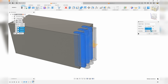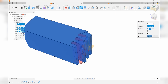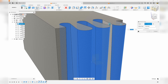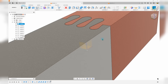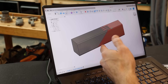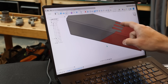With this design the opposing side is a mirror image but also rotated around, and it's very important to have the spacing correct — you can see how these line up. We subtract some parts and add others, and we're left with shapes that interlock. We do the same offsetting as before. These parts are designed to be more of a permanent connection, and with so much contact area they're harder to get together and harder to take apart. If you want pieces you can take apart, just add a little more clearance — I used 0.05 millimeters and it's just about right. You can also create a scarf joint from these connections, though for that I changed the angle to 0.5 and negative 0.5 degrees because the longer extension made the features become too big and too small.